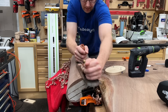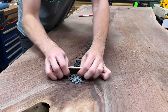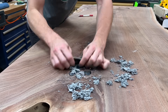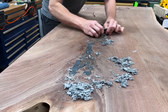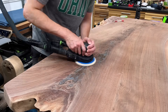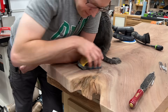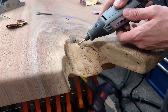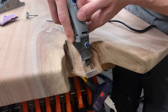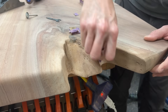And then it was the same process. After the power tool portion was done, it was back to hand tools with the jack plane and the spokeshave to get down to my layout lines. And once the epoxy had finally cured, I could scrape that off. Sometimes I use a card scraper to just get the bulk of it off because sometimes the sander will generate a lot of heat and almost reactivate that epoxy. Also, since there's a big hump, sometimes when you put the sander on top, it'll teeter-totter and you'll end up digging into your work. So if you get it as close to the surface as possible with the scraper, then you can come in with the sander and clean up the rest. Now, this crotch here needed a little bit of cleaning up with some hand tools and some dental picks, some files. And then I busted out the Dremel. This crotch had some divots and inclusions and battle scars that I really wanted to try to maintain. So with a wire wheel and then this little sanding flap wheel, then back to hand sanding, I tried to keep it as natural looking as possible but still clean it up nice and smooth.